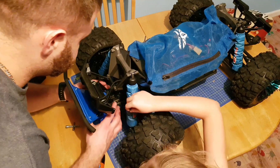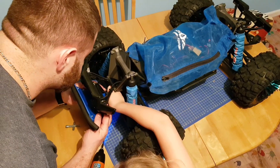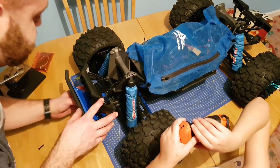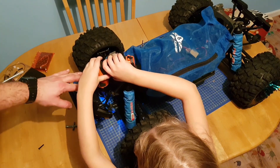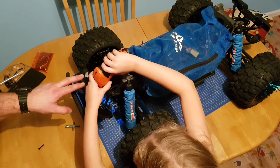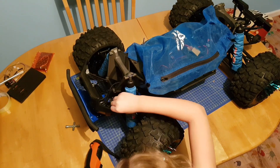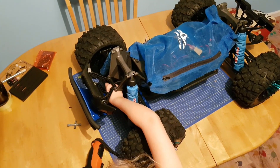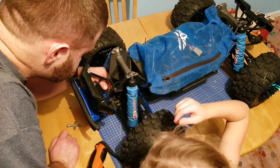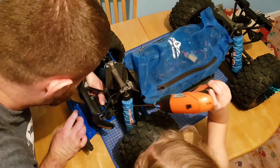So there you go Sophie — put it through the blue bit. It's fiddly and hard to get to. We're going to put the two supply bolts, which are M4 by 18s — these are also a 2.5mm Allen head. Drive that one in. And the last one — a bit fiddly to get to.